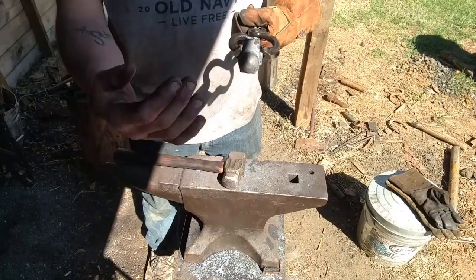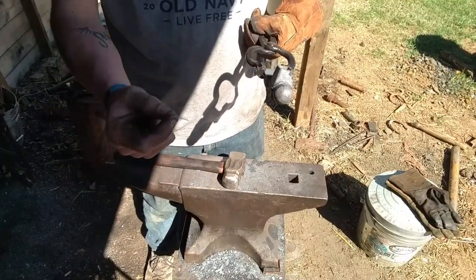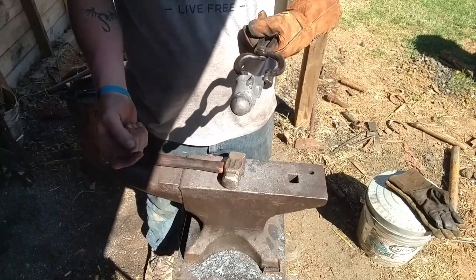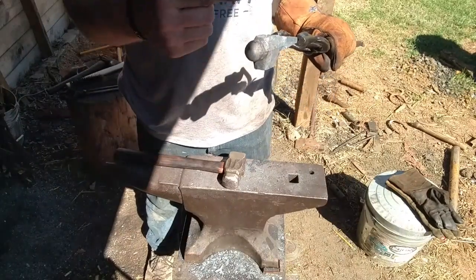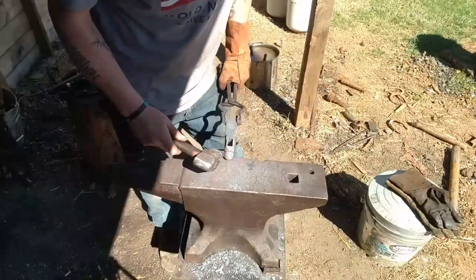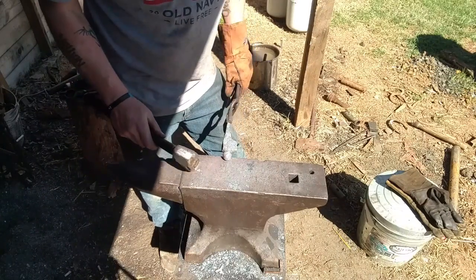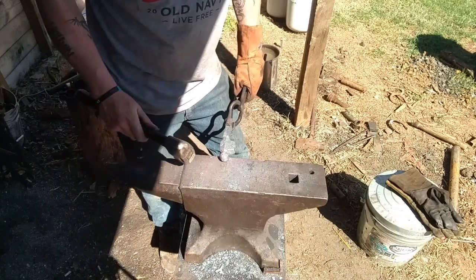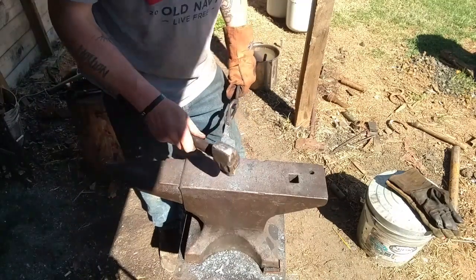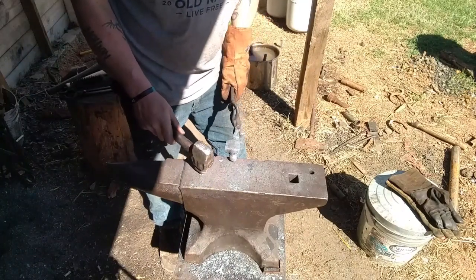You know, I do like a diamond point, just to give it something sharp, but yeah, a heavy point to maybe break up big masses of concrete. So I'll try and do some facets on this, bring it to a nice little diamond point, and we're gonna call that done. Square right to the edge of the head there. Just kind of slowly bring this point forward until we have a nice point.